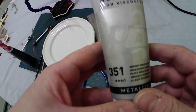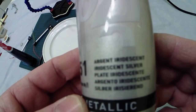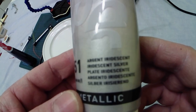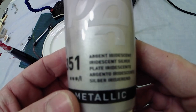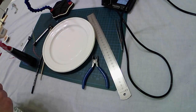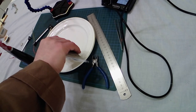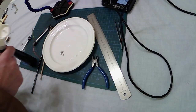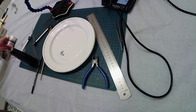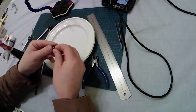Next step will concern the use of this silver iridescent color applied to the inside of the cap. Why? Simply because plain black is absorbing every light. Now if I want the light to be reflected towards the ground — to have a better illumination of the scene — I need to paint the inside of the cap with this color.